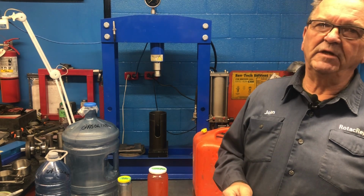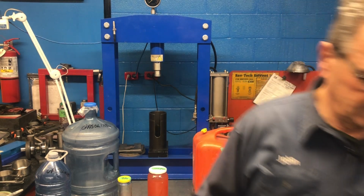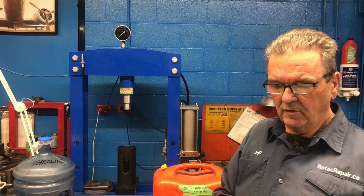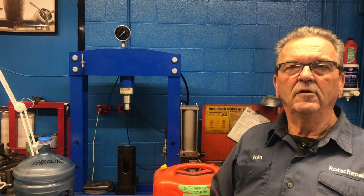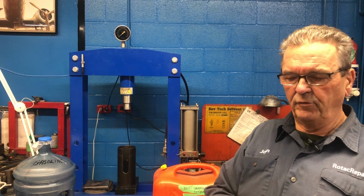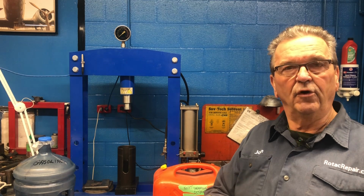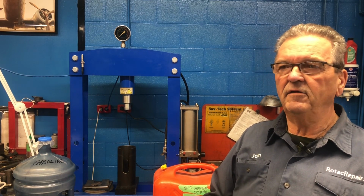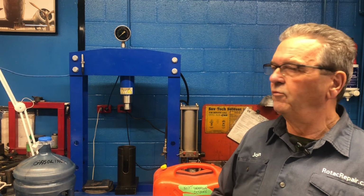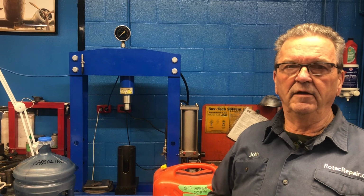So 90% gasoline, 10% ethanol with no water content. I'll figure out how much water that would take. According to my research, the maximum amount of water that this E10 fuel would hold is, in US gallons, 3 tablespoons of water per US gallon, or in metric, 11 milliliters per liter of fuel. It's 0.41% that is quoted there as making the fuel, what I would consider, completely saturated, or the ethanol content of it completely saturated.